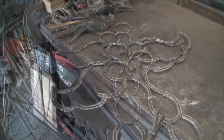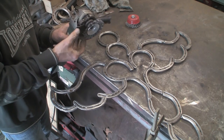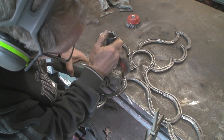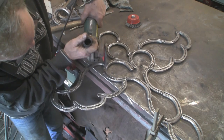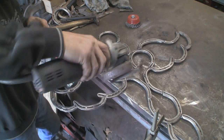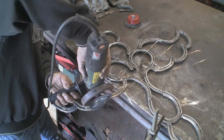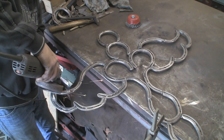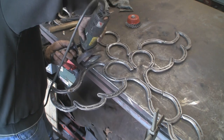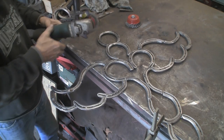Now I've done some of the front, I want to get into these grooves and get the muck out. So I'm just going to swap wheels. I've taken off the big cup wheel — that only runs at about 8,500 — and I've put on this little narrow disc wheel that runs at 12,500. So I've turned the grinder up a bit. This is a really cool grinder — it's 1,400 watts so you have a job to stall it, and it's about 6-speed so you can turn it right down for the brushes and tools that won't run fast, and then turn it right up for the ones that will.